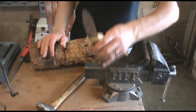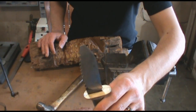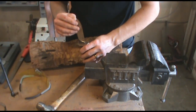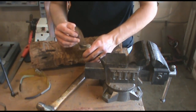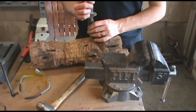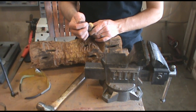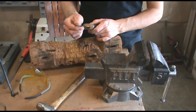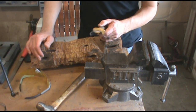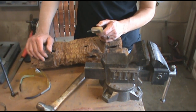There we go — so that's what a broken tip typically looks like. You can see that's a pretty good break. Now by looking at this, I can tell whether the heat treat is bad or if the tip was just too thin and it was abused. This one is nice — silky smooth grain on the inside — so I know the heat treat was done correctly. It wasn't the fault of the heat treating; it was the fault of the user, who slammed his knife into some hedge, twisted a little bit at the very tip, and it broke. You can see how little pressure that took.